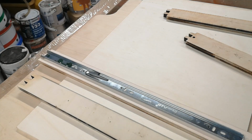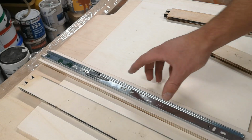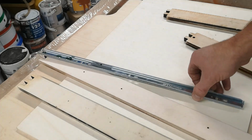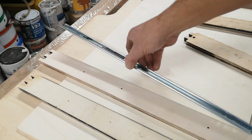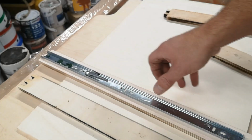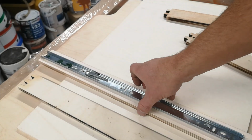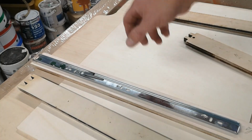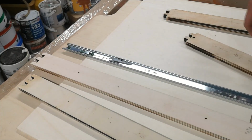There's not much tolerance underneath, in between the top and the bottom layer of the desk, so it's got to be accurate. So I thought I'll add these measurements onto the 2D design file before laser cutting. That way, when the drawer's assembled, all I have to do is just 1, 2, 3 screws in each runner before attaching it to the inside of the desk.